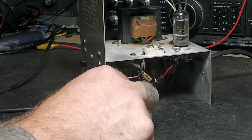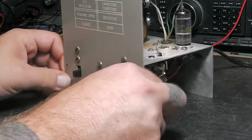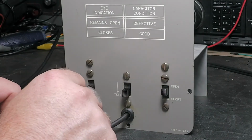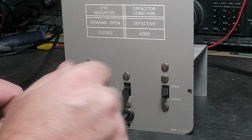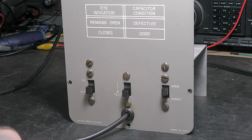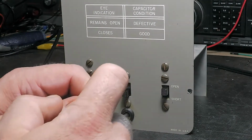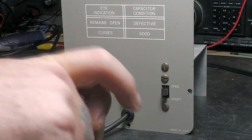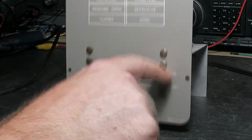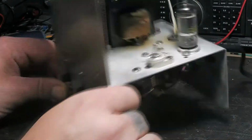And that's one reason I dug this one up out of the junk box. I was going to replace it, then I was like, wait a minute. I took it and cleaned it up. You can take a wire brush to them and clean them up, just real careful, or soak them in a little white vinegar or something a little bit, and go over them. And then put just a dab of oil in there on the other side, and then it'll slide back and forth. It's got another piece of wire in there that sticks up like this, gives it a little spring tension, so that if you turn it to this position, it doesn't just fall back down. So that's how those work. But I had to go through those and clean them up pretty good. They were really bad.